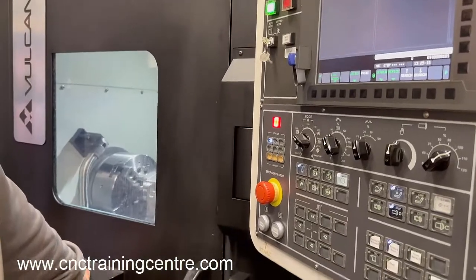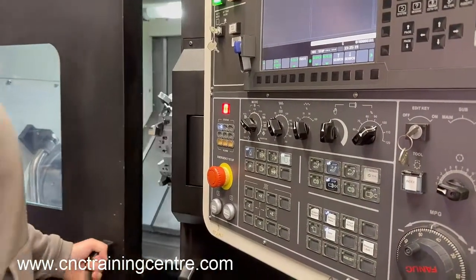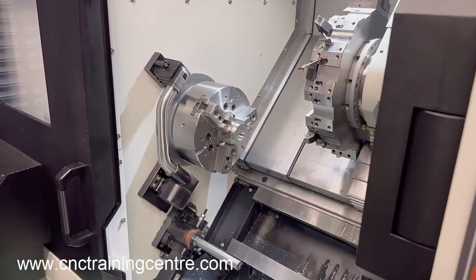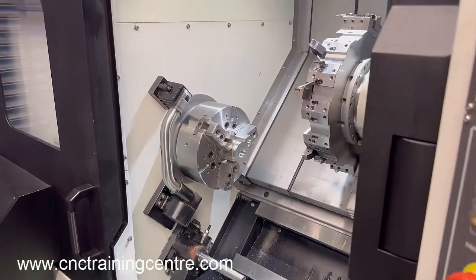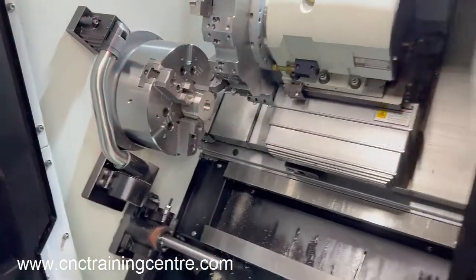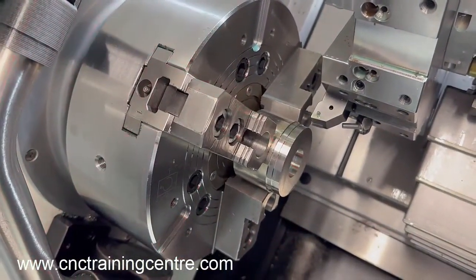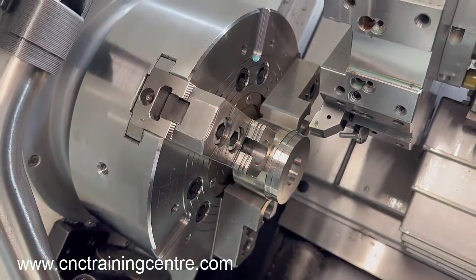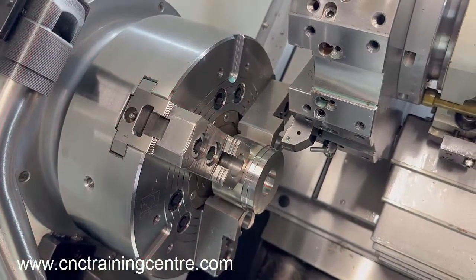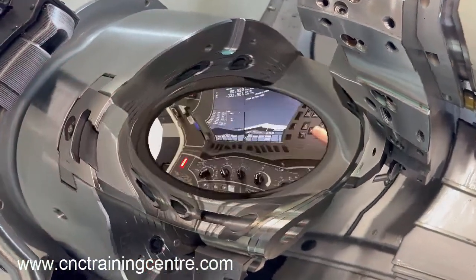Open your door. We're going to move that tool until it's touching the front face — or actually move it slightly beyond the front face so we're taking a cut. With that set, it would machine that front face off, and that's now going to be our Z0. So when we send that tool to Z0 that's where it's going to go, and all the other tools will work from it.